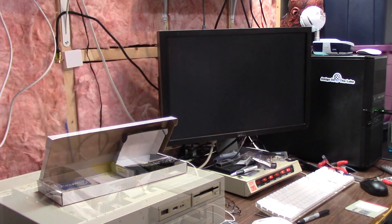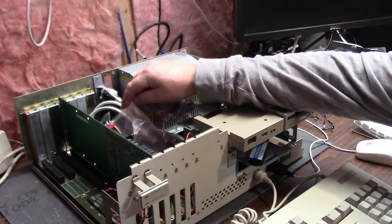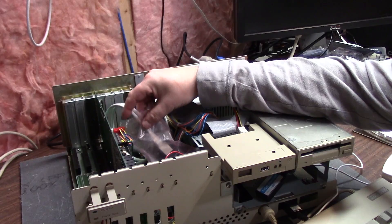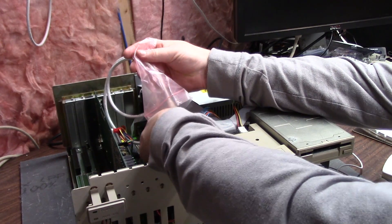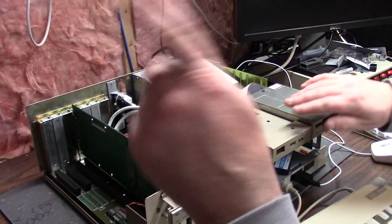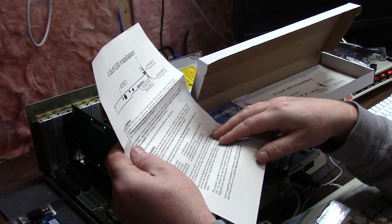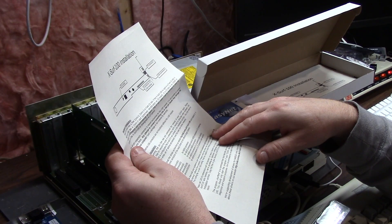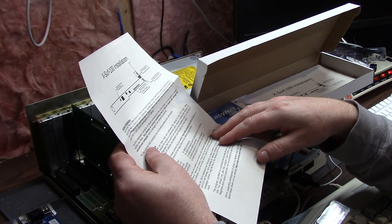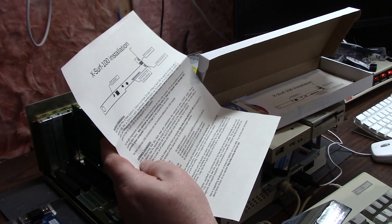Didn't look too bad. I'm going to leave my Vampire Ethernet, it's not hurting anything. What it looks like is this mess right here — this is my GVP 4008 with eight megs of RAM, and this is the little card I put in with the JTAG. But I'm going to need a slot. Insert the card to a free Zorro 2, Zorro 3, or fast Z2 slot. Close the jumper to downgrade to Z2 speed. The 48-pin expansion connector is meant exclusively for the USB module — it is not possible to connect anything else here. Two USB connectors are not functional without the USB module.